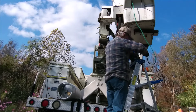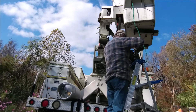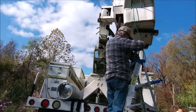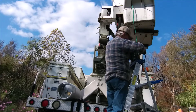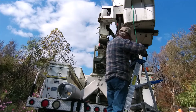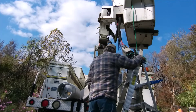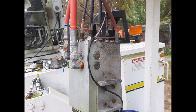Here I'm untying it from a rope. It helps to use a rope to lower it down slowly so you don't break any of the fragile hydraulic lines — those are just compression fittings. This takes the pressure off by just resting on top of the ladder. Here you can see the valve resting.